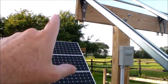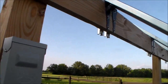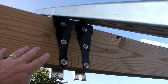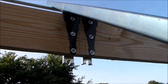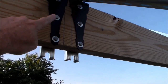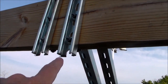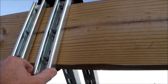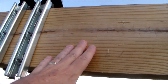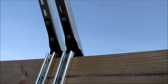The posts are pretty much the same as I did with this rack — I did a 2x8x12 foot beam across the top. What I did different here is I used a couple of heavy-duty strap hinges, just from the local Home Depot. I didn't use the screws that came with these; instead I used bolts and washers going all the way through. On the back I put nuts and washers including a lock washer, and I cut down a piece of smaller super strut just to give the wood a little more strength and support.